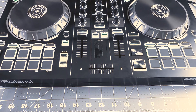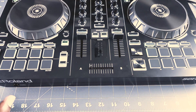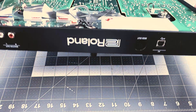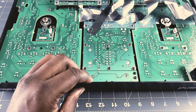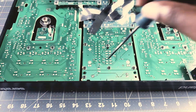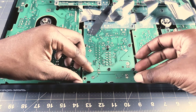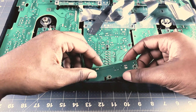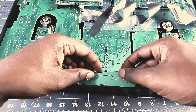If you're comfortable, congratulations — you have installed the InnoFader mini solder version in your controller and you're ready to put it back together. Go ahead and unplug it from USB and flip it back over. I recommend not leaving the programming button exposed if you can help it, because the case itself is not rigid and you may find yourself rubbing up against it over time. What I recommend is just pulling the fader out a little bit and bending it down to go underneath. If you feel like you're going to be constantly making changes to the settings, then you can leave it accessible until you get things dialed in.